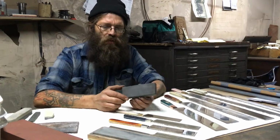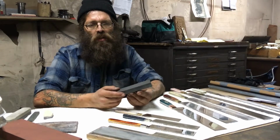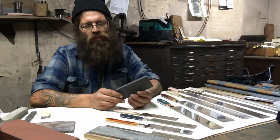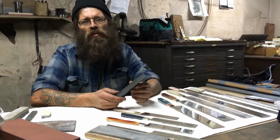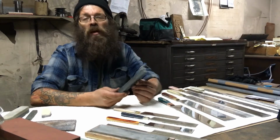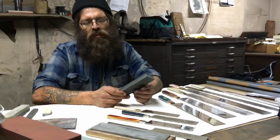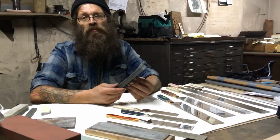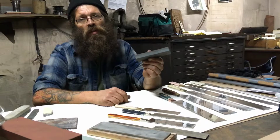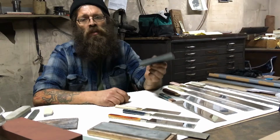One of these stones, a very basic, fundamental stone, is called a carborundum stone. These days, they can be a little more difficult to find. Their common replacement is the aluminum oxide stones. But if you do look for them, they'll be referred to as silicon carbide. They're relatively inexpensive, and in days of old, most of the work done on a Chalef by a shochet was done with one of these. It's a fairly coarse stone, they're fairly aggressive, but they can be used to do most of the shaping needed to achieve the desired edge.